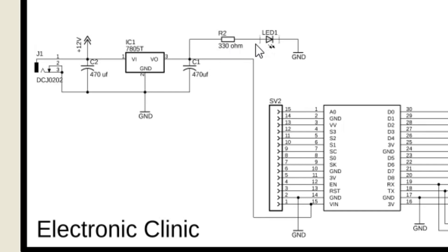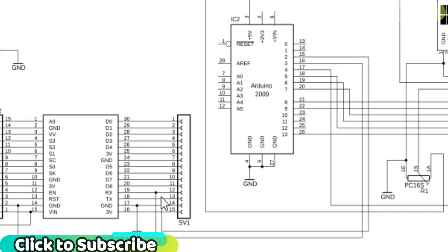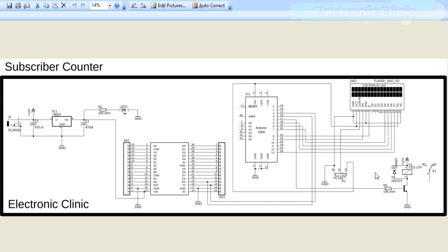I have a detailed tutorial on LEDs and how to calculate the value of the current limiting resistor — the link is given in the description. A wire from the output of the voltage regulator is connected with the VIN pin of the NodeMCU. Make sure you also connect the ground of the voltage regulator with the ground of the NodeMCU module. The TX and RX pins of the NodeMCU are connected with pin number 2 and pin number 3. A relay is connected with pin number 13 of the Arduino to control the bulb. The relay driver circuit consists of the 2N2222 NPN transistor and a 10k resistor.